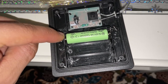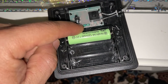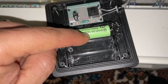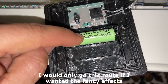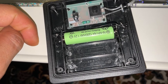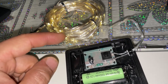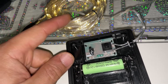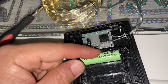There are two more battery slots that weren't filled, so I wanted to extend the plate and add three larger capacity batteries — Energizer rechargeables at around 2300–2400mAh. If I add three of those in parallel, you add all the milliamp hours together: 2300 times three is 6900mAh. This thing would stay on all night until the photo sensor detects daylight and switches to charging mode.